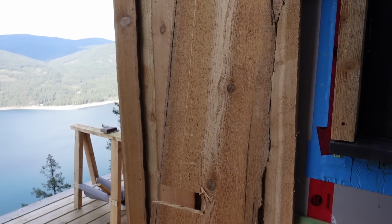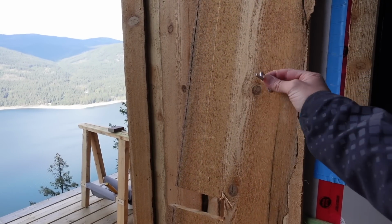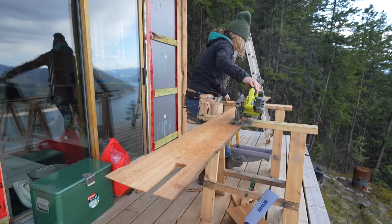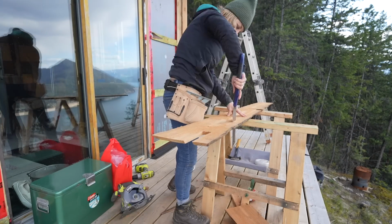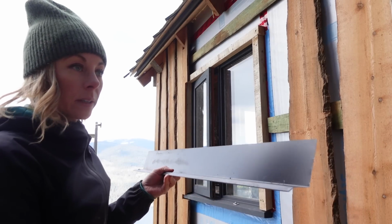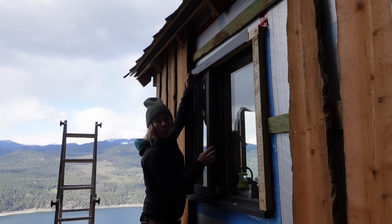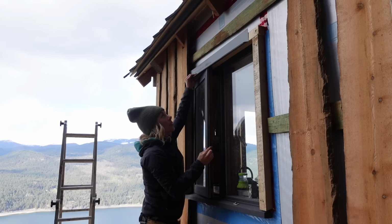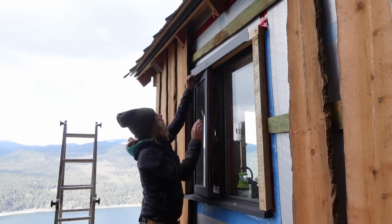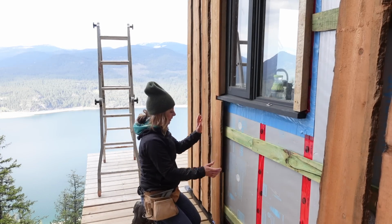Okay, I took this thing and just wrapped my hand in there and was able to create a line with it. The other thing is, I did get this drip edge stuff, so I may as well use it. It would go, I think, like this against here, and then I would put the siding on over top. But I was thinking ahead and wanting to make sure that I could still open the window, and the window won't open with it like this, so I have to change something. You'll have to cut the siding up a little bit higher. And by George, an hour or so later, I think I have this piece finally good to go.